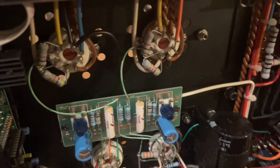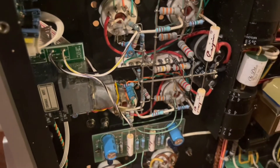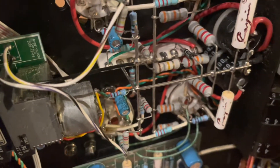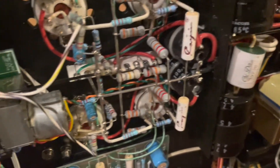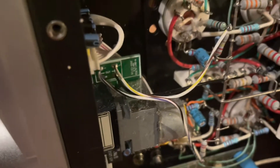These are the two power tubes. On the left you'll see there's an orange wire — that's the positive side of one. Then you see the blue wire — that's the positive side of the other, and there's a little bar that goes between two of the pins. In the middle it almost looks like a tree with a bunch of different components — there are some capacitors and resistors hooked to it. That's ground right there.